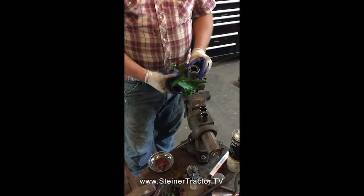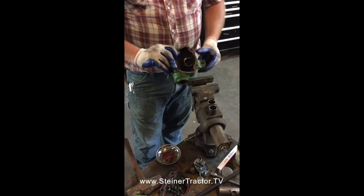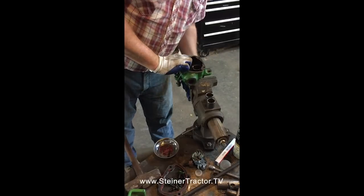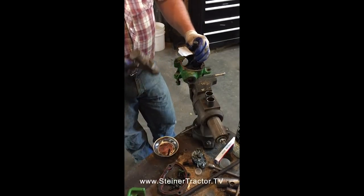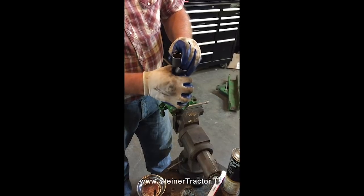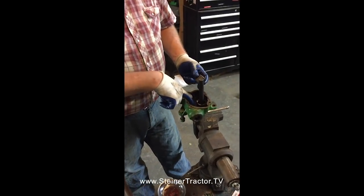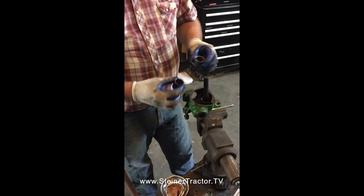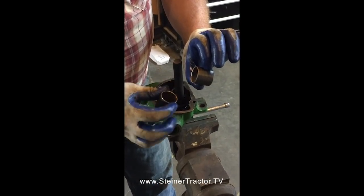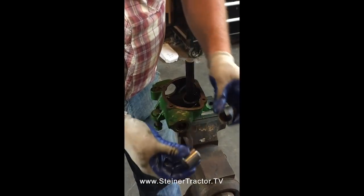and then we'll work on our steering gearbox housing up at top. So we've already removed our grease seal from the old housing, and I've already begun to drive the bushings downward from the top using my bushing driver set. Put them in a vise, and the way our bushings were installed inside, you've got a bushing on top, bushing on the bottom, seal down below, and then there's a space in the middle, and the gap is there to allow oil. There's a hole in our gearbox to allow oil to get down and lubricate both of these bushings. You'll also notice these bushings have galleys, one on each bushing, that's milled inside. I don't know if you can see that very well, to allow grease and oil to get around the shaft.